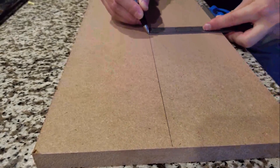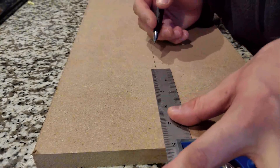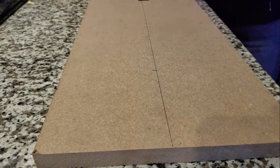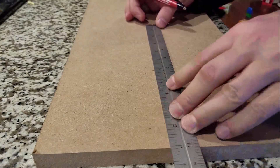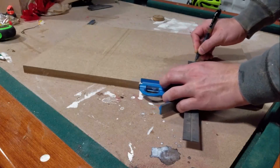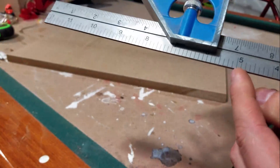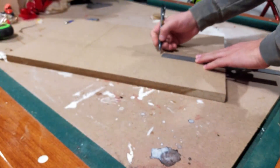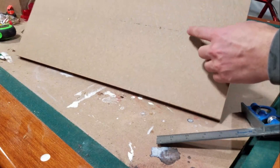We're going to start marking our speaker cutouts on our center baffle by drawing a line directly down the center. We're now going to mark the center hole for the mids at exactly 5 inches from either side, and the tweeter at 11 inches. We also need to make some markings for the subwoofer, which will be on the very top plate — measure 5 and 5/8 inches from the rear and 6 and a half inches from the side to get the middle point.